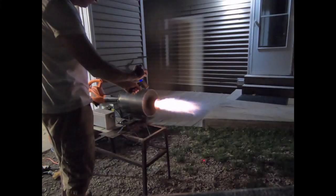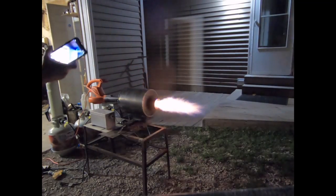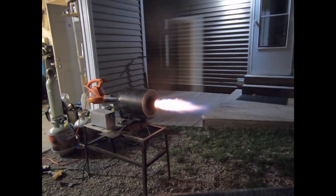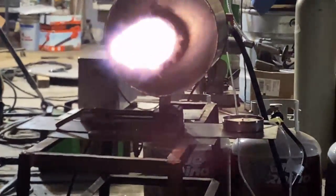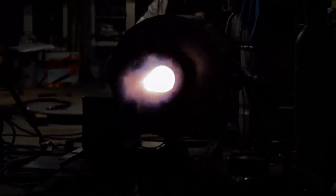You can see there we were taking a look at some shell temperatures — the ambient temperature is 74 degrees on the ground. We're also getting the benefit of an air preheat. This is a furnace burner, so we're not losing any heat off the exterior like we would in some of my other designs — it's all being directed back into the furnace, which is pretty good for performance.